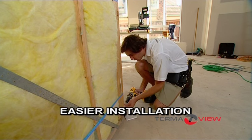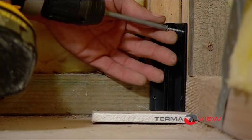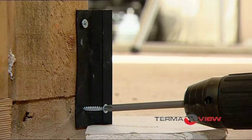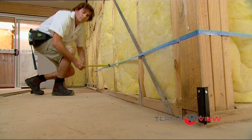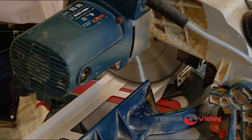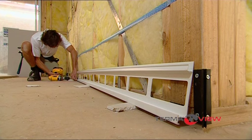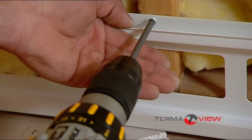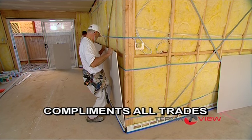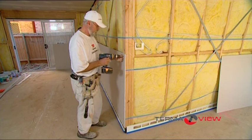TermiView is so simple and much easier to put on than normal skirting. There are no mitres and no scribing to be done. First step is to put on your internal and external brackets. Next step is to put on the backboard — simply measure, cut on a drop saw, and then simply screw straight into the stud wall. Then your plasterer cuts the gyprock, slots it straight into the channel provided at the top of the backboard, and then screws straight into the stud wall.